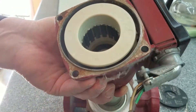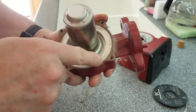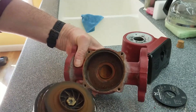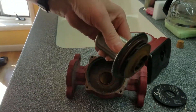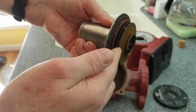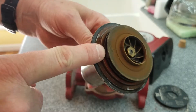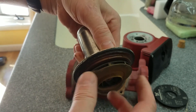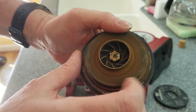Here is the cartridge that would typically come out of here. This whole thing can be replaced - and there's dirt and rocks and stuff coming out of it! So there were rocks rattling around in there. This is the little impeller right there - it sucks water in and then spits it out. A tiny little thing is all that's needed to get water moving through all the pipes in your house. I'm going to have to clean this up with some Iron Out, but that's what's in that pump.